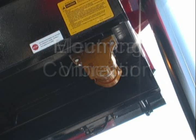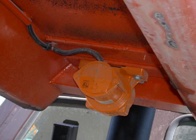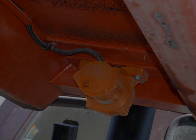The location of the vibrator on the truck body must be chosen such that the force created by the vibrator is introduced into the material at all possible sticking points. This means the force needs to be coupled directly to the spine or backbone of the body. The best location for this is just behind the doghouse, or at the front of the underside of the body between the spines that run the length of the body. Not all dump bodies have a doghouse, as can be seen by the example within the video. By mounting the vibrator mounting bracket attached to both main spines at the front of the body, the vibrator force will travel into the material along the length of the spines and outward from the spines to the sides of the body.